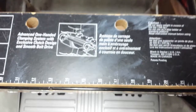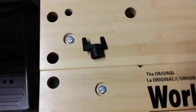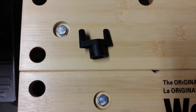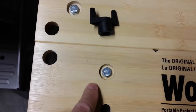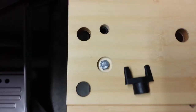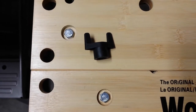I don't know that I'm going to seal inside the dog holes unless the sealer is very thin, because I don't want it to bind my bench dogs. Periodically, you also want to come back and tighten down the bolts to make sure they're nice and snug. Use the thumb wrench that was supplied with your bench if you still have it. If you're using a regular socket, make sure you don't tighten it more than finger tight — especially on this one, or you'll strip it. It'll also make the jaw vise too tight to move back and forth. This is metal going into plastic, so you could literally strip it out. Finger tight is all you need.